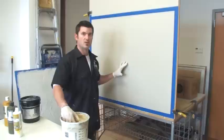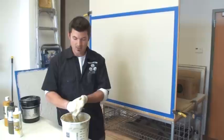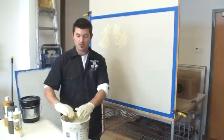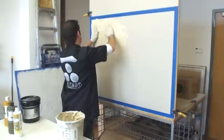I'm doing this on a smaller surface area because generally I wouldn't do this finish on an entire wall - I do this a lot on kitchen hoods. I've got that Plaster Text mixed up, so I've gone from white to a nice warm color. For this application I'm going to use my hands, so definitely want to wear gloves. I'm just going to stick it on - it doesn't matter how it goes on. The first rule is you've got to get your material on the surface before you manipulate it, so I'm just going to start spreading it around like I'm finger painting. You want 100% coverage because we're going to get this in one coat.